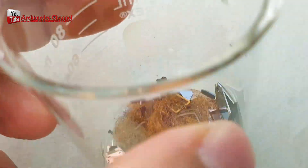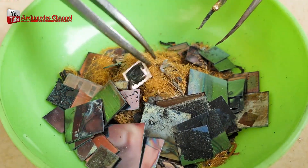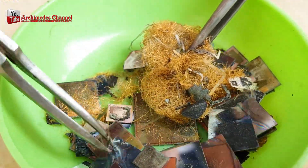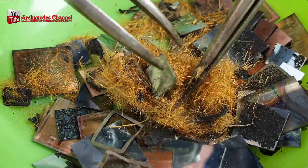The black compound is completely dissolved by sulfuric acid, leaving a die chip with large amounts of gold wire attached and possibly fiber strands. Use water to clean the gold wire. Be careful of the chemical reaction of sulfuric acid and water — wear protective equipment.